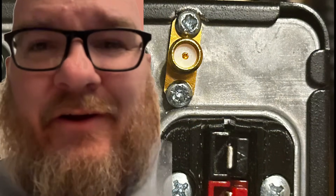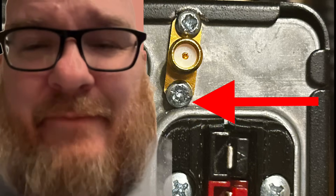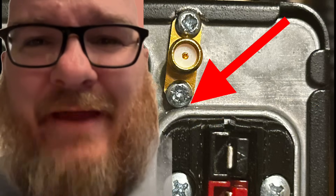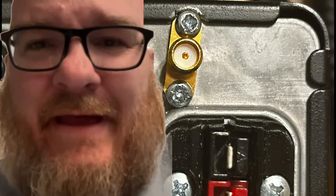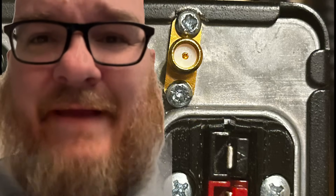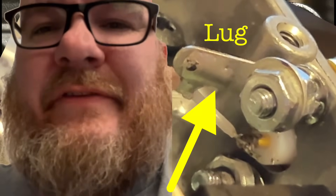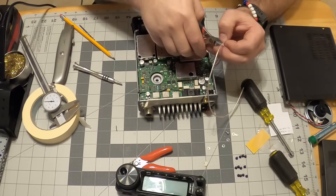Let's talk about this installation — it's a little crooked, a little high, and a little to the right. I had to cut out a little bit of the lid to make this work. Next, drill two holes in the back and put the screws through the RF connector and through those holes. Put one of the lugs on the back so that you can solder a wire to it for the common connection, and that will complete everything we need to do back there.